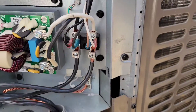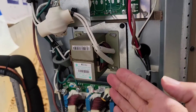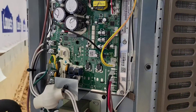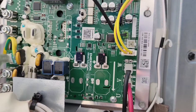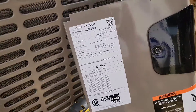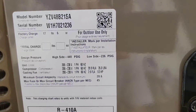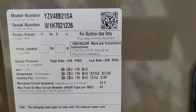Here is where our power wire comes in, and we've got our reactor and our inverter board. This is what drives the three-phase compressor — these are the wires that go to the compressor: U, V, and W. There are great resources online, including York training available through HVAC Navigator. Check that out as well.